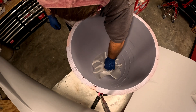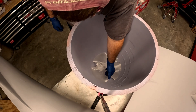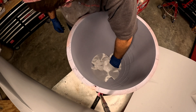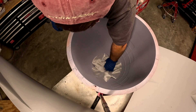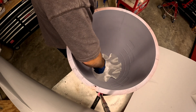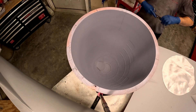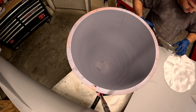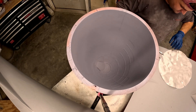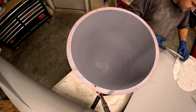First step, I'm going to take this first layer of glass — it's laser cut — and just put it in here to see how well it lays down into the mold surface. Unexpectedly it's going to need a good bit of slots cut in it. I can see one, two, three, four, five of them, so I'm just going to make a wild guess on where those five are going to be and cut a couple of slots — not all the way to the middle, just about four or five inches — and we'll see how it fits.